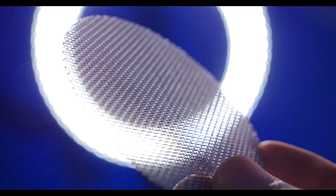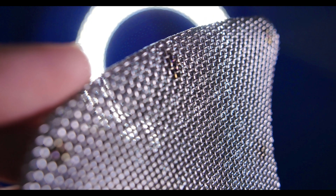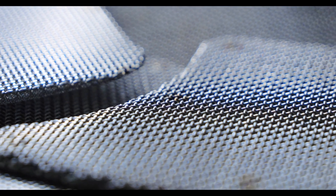The first question you should be asking your wire mesh supplier is whether or not they have the capacity to stamp the shape you need correctly. If the required tooling is in-house and the material is available, the wire mesh supplier should be able to fabricate the component with minimal lead times and at a more budget-friendly price point. But if the mesh supplier has to design and create a new die, you want to provide drawings that best illustrate the shape, dimensions, and specifications of the component. Naturally, this increases both the lead times and costs associated with the component.